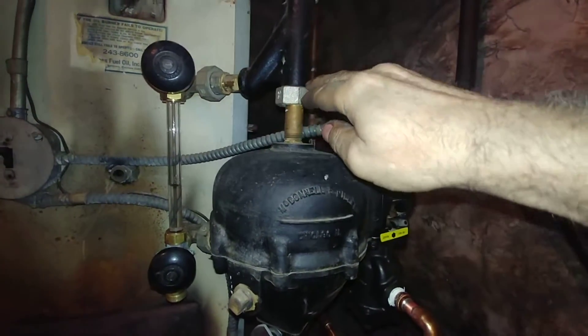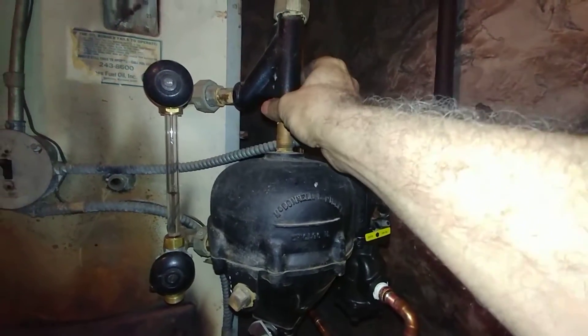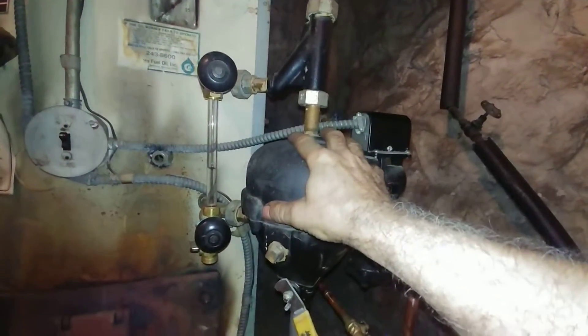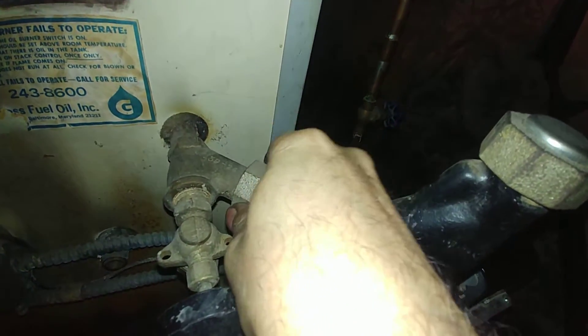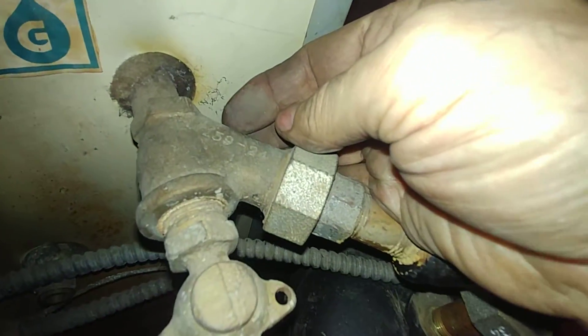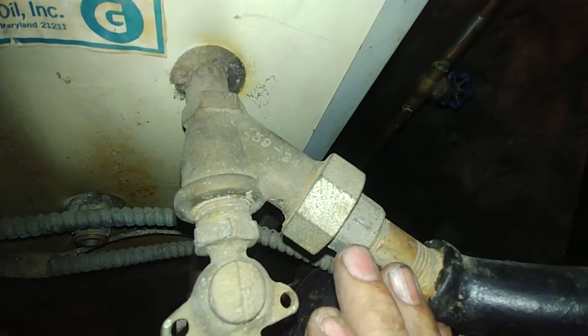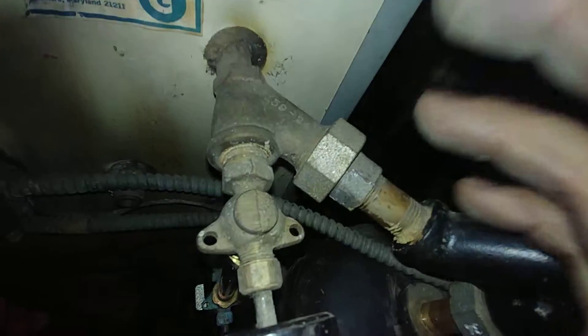They're a fairly clever mechanism up here. This is adjustable in height and also takes care of any misalignments when installing this thing. There's a quick disconnect union up here and here, and these are OEM fittings — I must warn you, if you ever have to remove these, they are cast and quite brittle, and on more than one occasion we've had them break off inside the boiler.